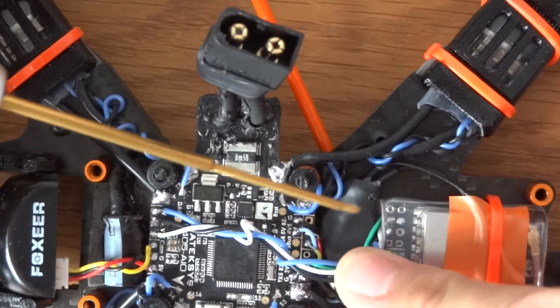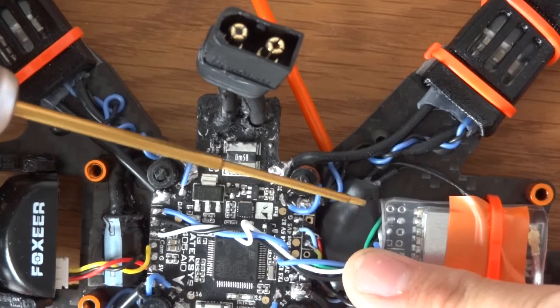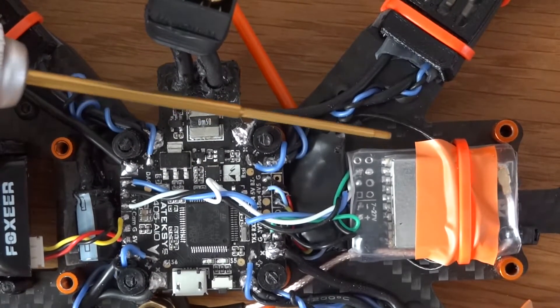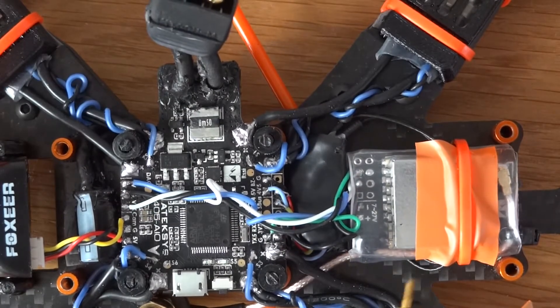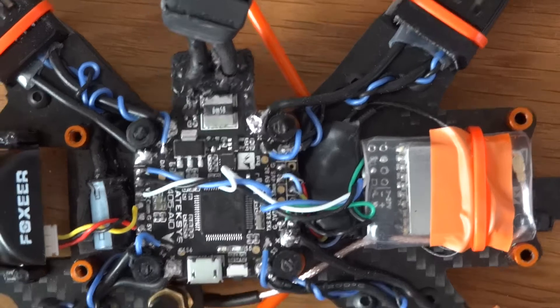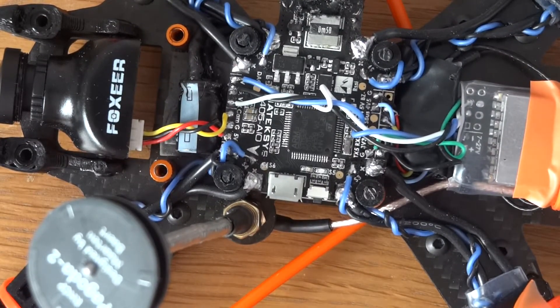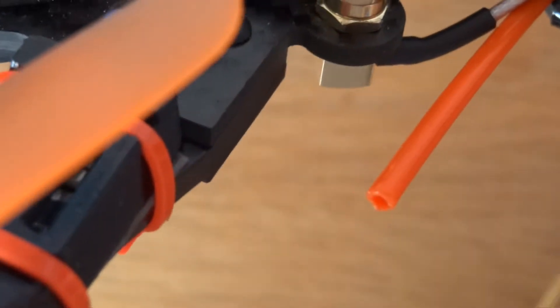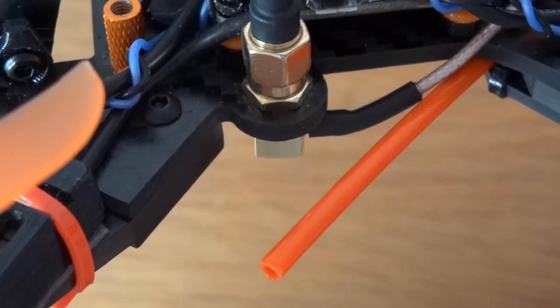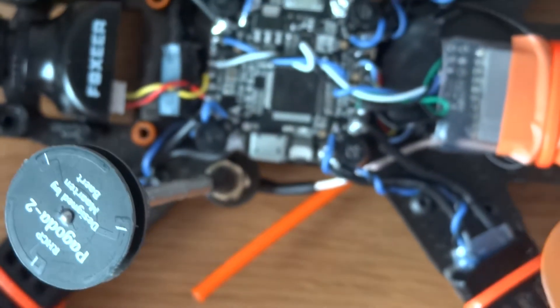The XM Plus receiver is sat in front of the VTX here — I've put black electrical tape on it and it connects with three wires. It's quite tight so you can't really see it. I've looped the antennas through and run them out the side, using two of my son's orange drinking straws just to keep them safe. I've tie wrapped the drinking straws through the nice hole that runs through where the plates sandwich together on this particular frame.